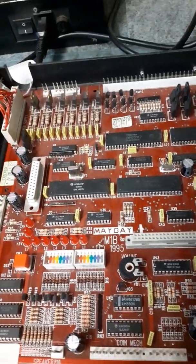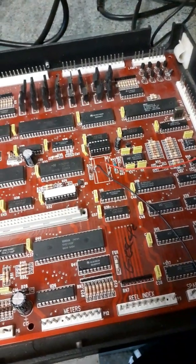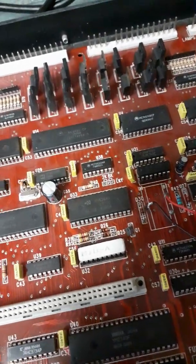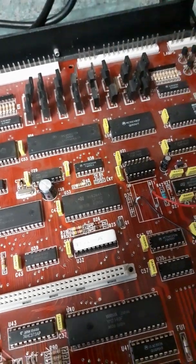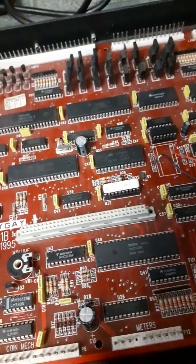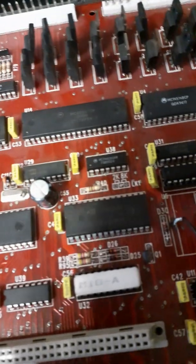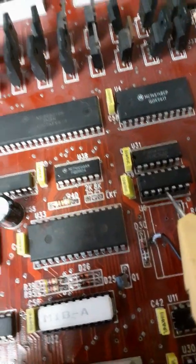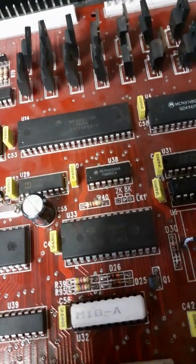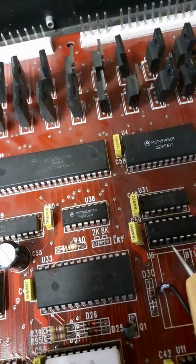Right, so this is Andy's first board, which he sent that didn't boot. I can't remember exactly everything to do with a board when you're doing so many, but one of the main things with this was no clock on start, which is U6. Any one of these M1A and B boards, and the M1, which I haven't done many of, needs a clock.